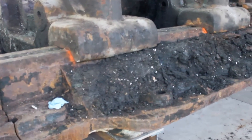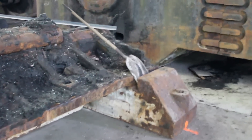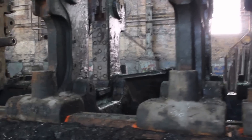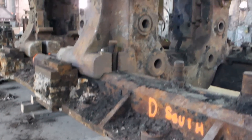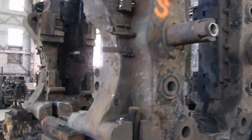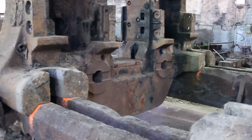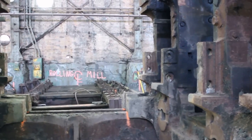The setup looks a bit like railroad tracks. The cross tie is called a sole plate, and three of those would be embedded into concrete. The rails are called mill shoes, and each one of these is called a housing. At the main mill stand you can see the two sole plates, the mill shoes, and the rolling mill housings. There are two recesses where the vertical roll fits in, and cross ties go back and forth between the two stands.